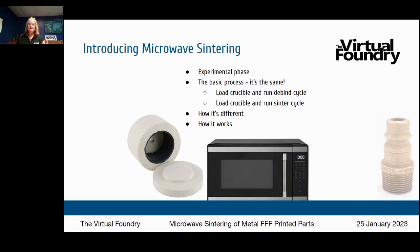The microwave kiln is a common item you can find on Amazon for under $50. It's two pieces — the cup and the lid. It's white around the outside and gray around the inside, and that gray part is metal — likely silicon carbide. That silicon carbide acts as a heat concentrator for those microwaves. What's really cool about this process is that you can get to higher temperatures than with a regular kiln, and you can do it much more quickly.